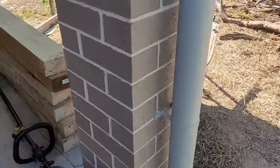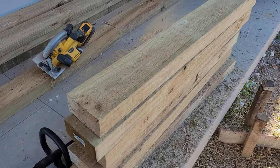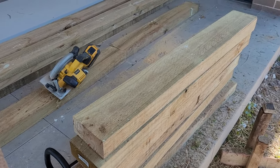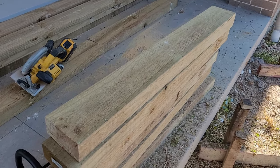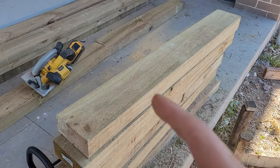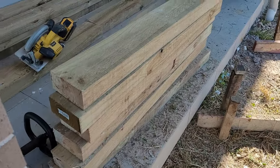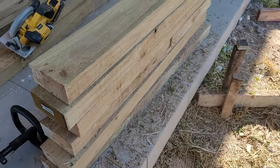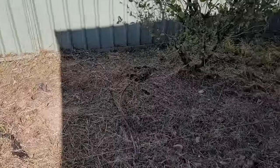That's a timber post. It's 125 by 75. We have a three course sleeper, which will be 600, and then 600 to the ground with concrete around it. We use quick set concrete to set the post and install the timber post as well. That's H4, designed for landscaping, touching the soil and in the wet area in the soil, to be long life.